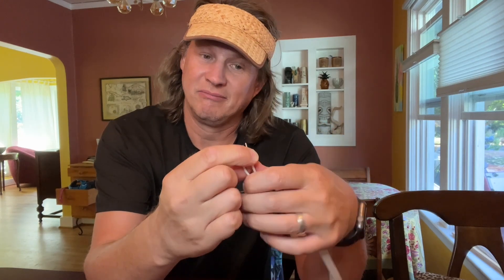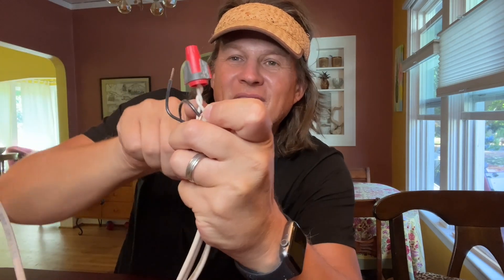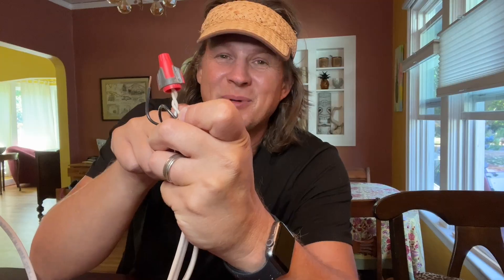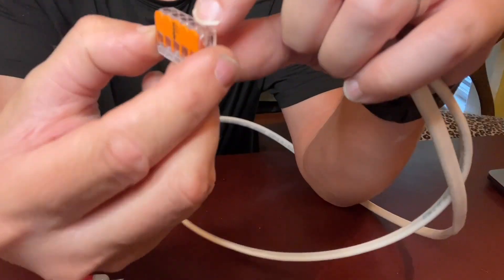And if that wasn't enough of an explanation, it comes with a little instruction sheet too. So I never used wire nuts correctly. With wire nuts, when you wire two wires together, you actually, according to code, have to wire it past the point where the wires are clamped to the point where the area that still has insulation on it is twisted together. This is what it's supposed to look like, and I never did that — I always just twisted it together until it felt good and pulled on it maybe. But that's the right way. Then if you have to rewire something, it's a pain to use one of these older connections. With these, you can just flip it open and pull the wire out — super simple.